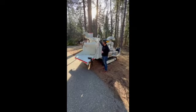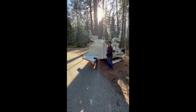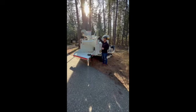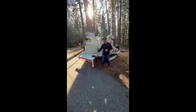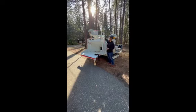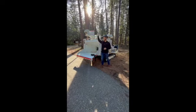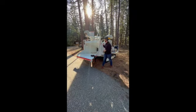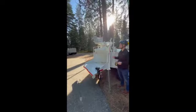Essentially, you have an engage and disengage here on your winch controls. Up is engage, and to disengage you drop it down. Engage, that pin is into the spool, everything is running through the remote, you're hydraulic driven. When we go down to disengage, you're pulling that pin out, you're running everything out by hand, running that rope to the log and tying it up. At that point, you set it back to engage and pull your rope in.